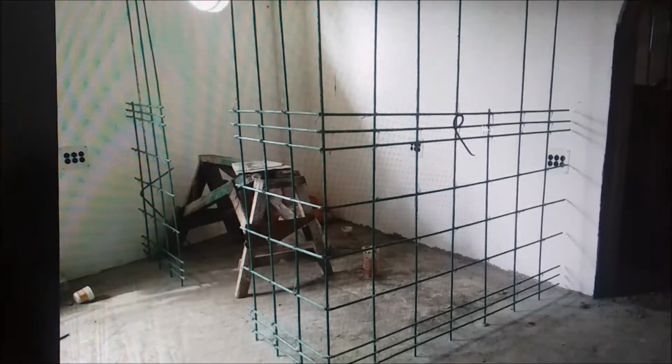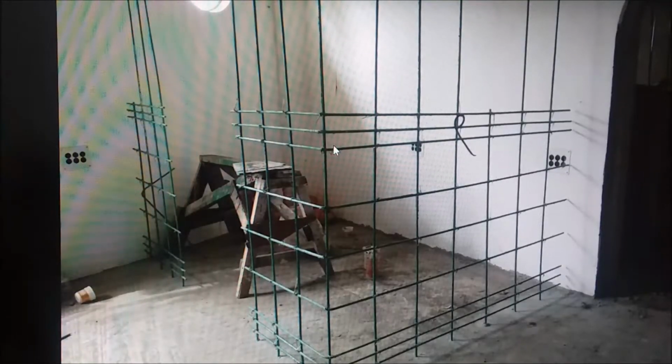You cut notches where you're going to put your rebars. So you can stand those up around here and set the bars in the notches and just tie them. We notch board just about everything in the house, have from the first day. I don't know if anybody else does it, but that's the way we do it.